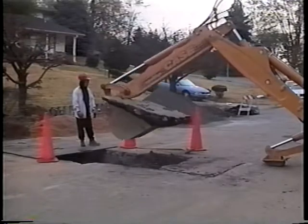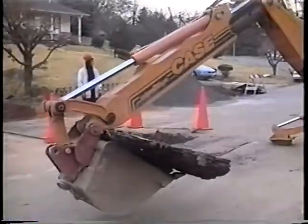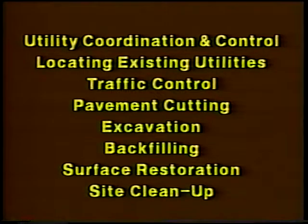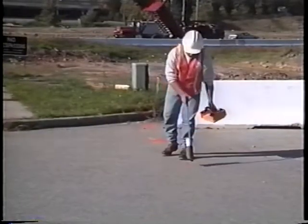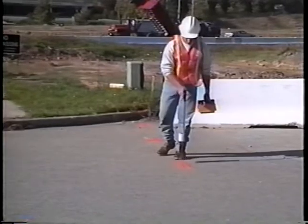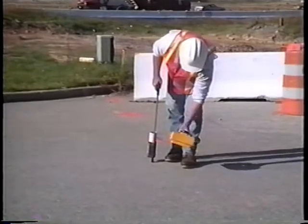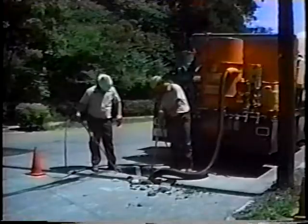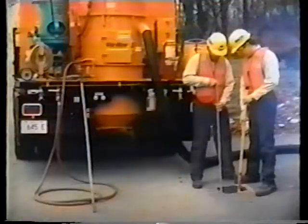Other types of equipment may also be used. Once the pavement has been cut through and the pieces are removed, the next step is excavation. A number of issues must be looked at here, all of them having some relationship to safety. First, it cannot be stressed too much: locate all underground utilities in the area before starting to dig. In highly congested areas, consideration should be given to using non-destructive vacuum technologies to locate, uncover, and repair existing facilities.